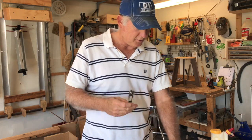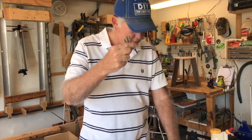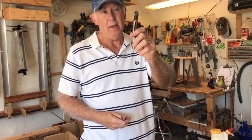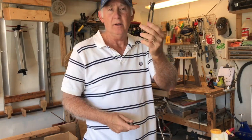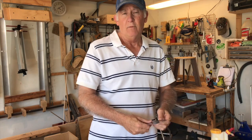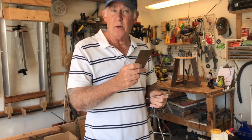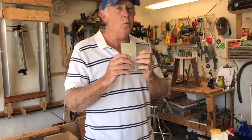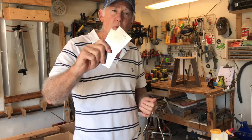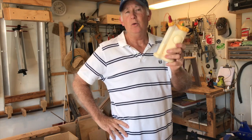This is a plug cutter. One of the things you'll find as you use pocket hole screws or dowels is that sometimes you want some custom dowels — here's a couple of walnut dowels and a couple of oak dowels I made with this plug cutter. It cuts up to three inches and is a lot faster than drilling a hole and hammering through. For burn marks on your boards after sawing, a card scraper is the tool. I didn't know what a card scraper was until a good craftsman told me — it's more aggressive than sandpaper but not as aggressive as a plane, and it's great for getting a nice smooth surface before staining.